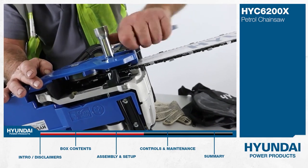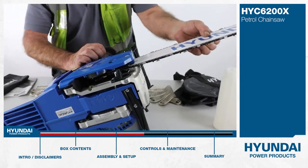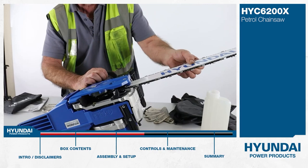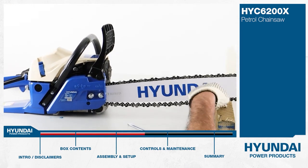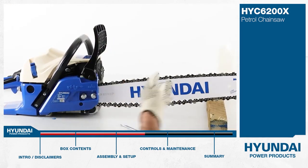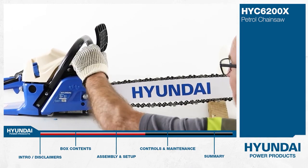Okay, that's very nearly there. Just come back half a turn, and that keeps the chain bar loose. Now we do need it to remain loose when we do our adjustments. So these 2 nuts are loose, and you'll notice I have the chain bar on a piece of wood just to hold it up. So the weight of the chainsaw is down, and that's kicking the bar in the upwards direction. Let me just demonstrate.